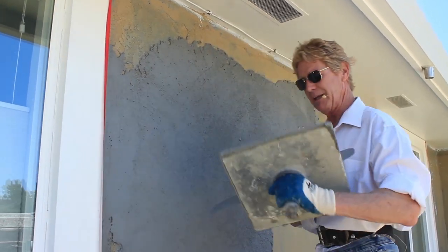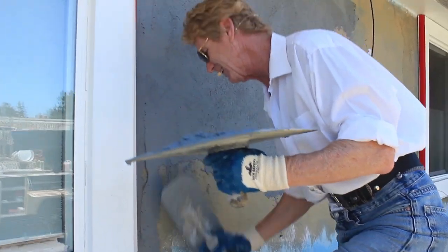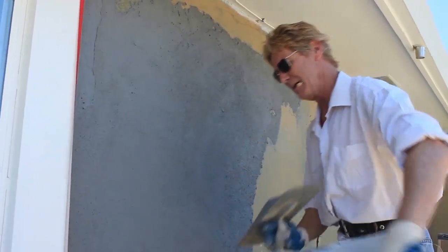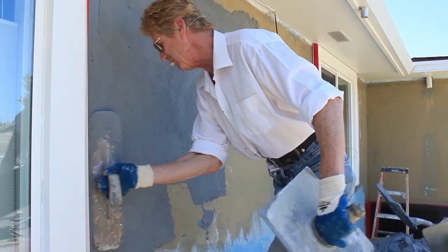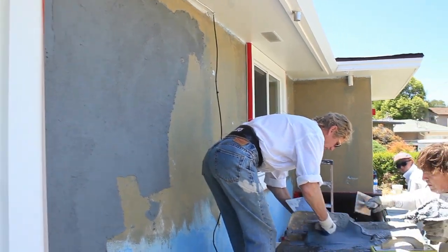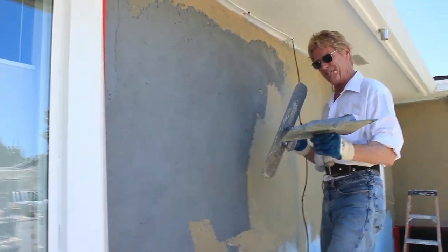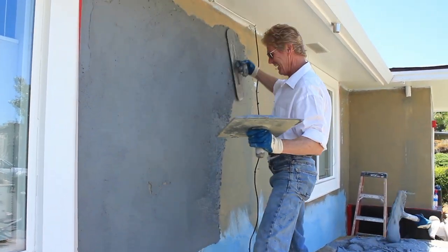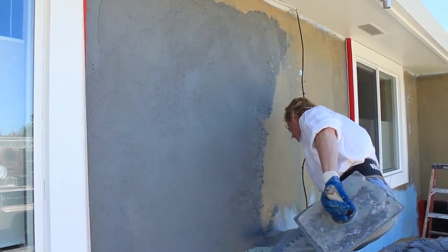Because Madeline taped all this I can just knock it out — that's nice. Bill's hitting the bottom for good reason. What we're doing is a lot of things at once — I'm spreading this side and Bill's spreading that side. One thing about a color coat is you don't have the luxury to take your time. If I stop, that creates a joint — and I'm not talking about that kind of joint. A joint means like pouring Clorox on blue jeans when you're washing clothes — how it stains.